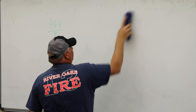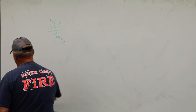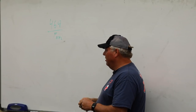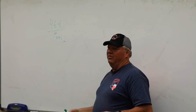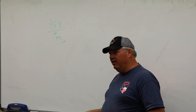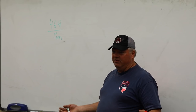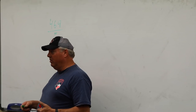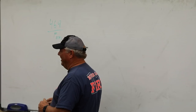And they always tell you to make it a little bit longer because you're going to cut it to length. That's exactly right. Cut it down. Because depending on the wire and depending on the velocity factor of the wire, whether it's insulated or not, how thick it is, how they manufactured it, is it oxygen free, all this garbage that I personally don't care about. So what we're going to do is exactly what Brian said. We're going to make our dipole a little bit longer.